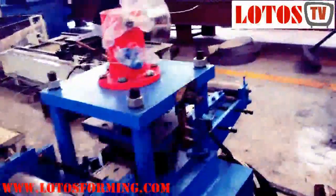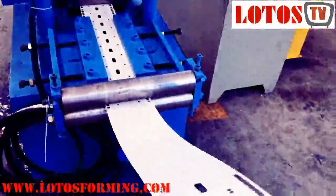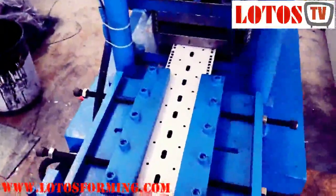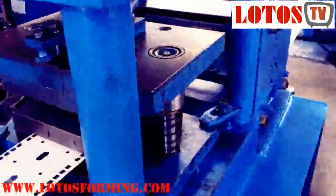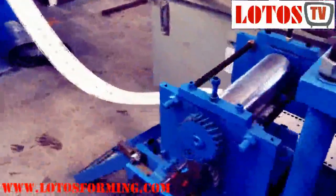You can also follow us and subscribe on YouTube to get weekly videos of our roll forming machines. Here is the input material — we tested with 0.5mm PPGI white color. You can see we have an input guide left and right that you can adjust. With this punching unit, we make all the holes together — small holes and big holes — all coming from here at the base material.